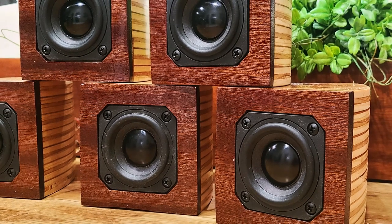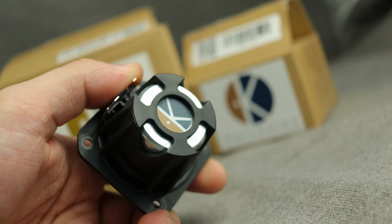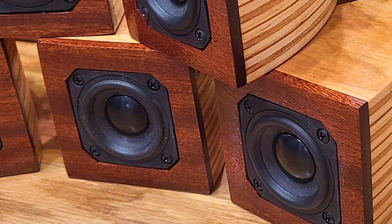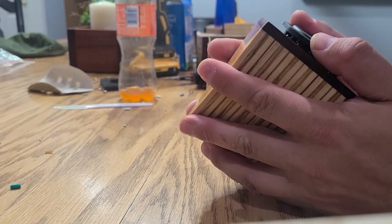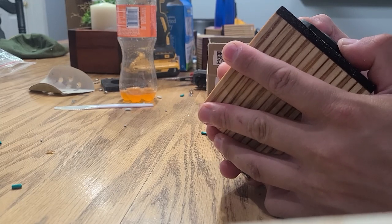I love the fact that with DIY you can really do whatever you want, so the Bose concept was just a cool idea. But there are a couple things you need to pay attention to with the two-inch driver. One, this has dual-neo motors, and because of that it takes up a lot of space in the box — a lot more than a typical two-inch driver. Also, the faceplate is a little weird, and for DIY work I'm just not a big fan of it. I'd rather it just be either square or circular, which makes it much easier to make a front baffle. I had to use a CNC to make the front baffle. Also, with the amount of space taken up by the dual-neo magnet — although that should give it better performance — it makes it a little bit rougher to put in a smaller box.